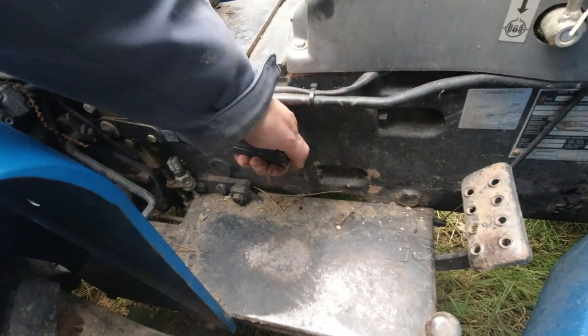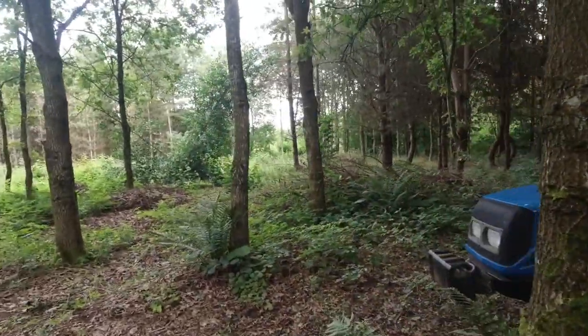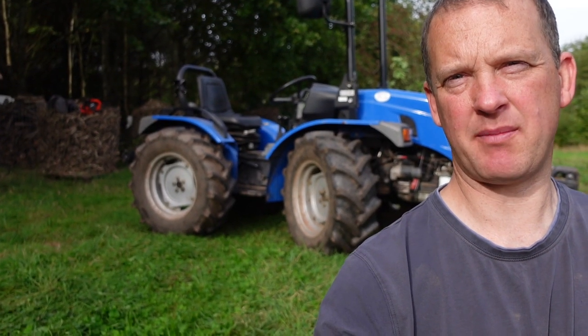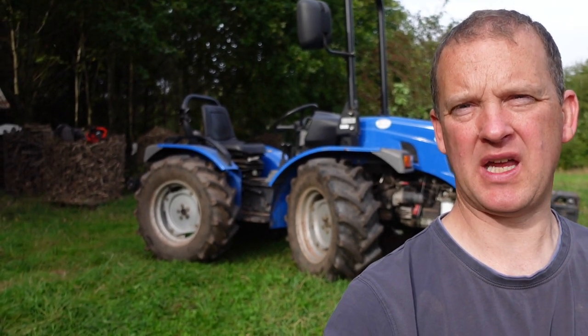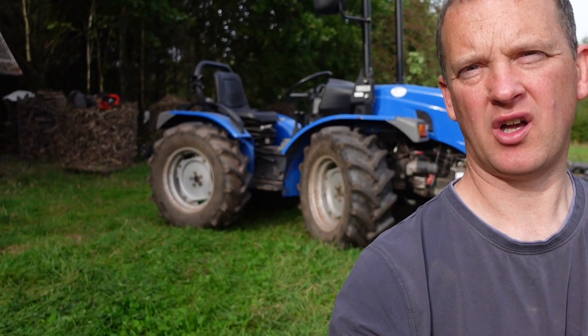Is it perfect? No, there are some little niggles I don't like. I don't like where the handbrake is because I guarantee I catch my hand on it. Sometimes I find the ground clearance a little bit on the low side — going over stumps in a woodland, if the ground's soft you can get quite close to some stumps. And as I mentioned, sometimes the linkage capacity lets it down. It'll safely lift about 350 kilos on the back, so a heavy duty flail mower or my branch logger is really on its limit. In a woodland with that amount of weight on the back, you've only got to go up a bit of an incline and it starts to pick the front wheels off the ground. That, for me, is possibly its biggest limitation — the linkage capacity.